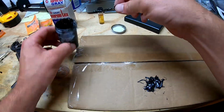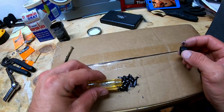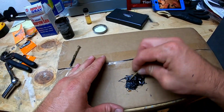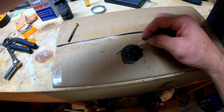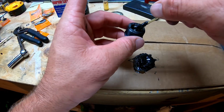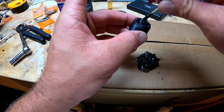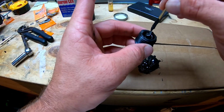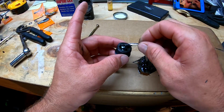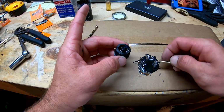All right. Basically, my 5-to-1 ratio is just kind of cover the black slightly and start mixing it till it softens up. Next step is get you a little spoonful and you're just going to drop it down in there. I just kind of tap it down too to make sure it seats all the way down. Basically what this is doing is it's going to lock that bolt and that nut in place. So if you tighten it, loosen it, whatever, or when you're spinning that eye bolt to put it in place, it will not come out.